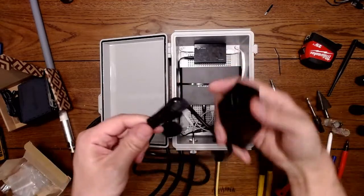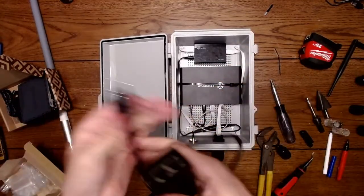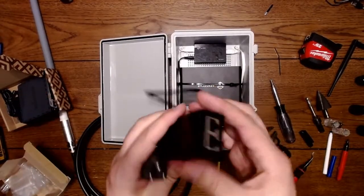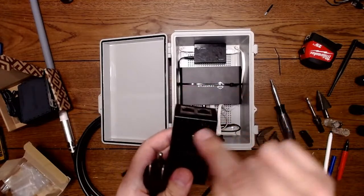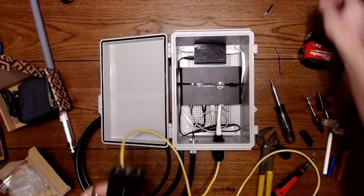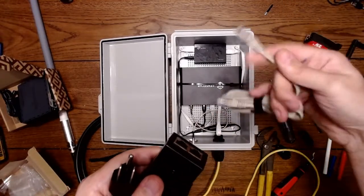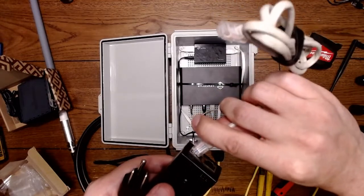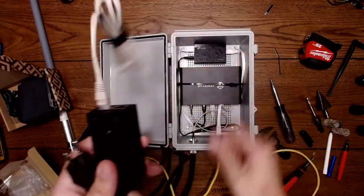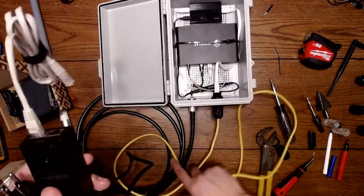This is the very basic system that you can get, which is a PoE injector. And a PoE injector just has a power cord. You plug this in here. You plug this into your wall. You take Ethernet from your modem or your splitter, whatever you have. So say this was coming in from your Ethernet, from your house, from your modem, or your switch. You put your Ethernet into this port. This is coming in. And then this would go directly to your box.